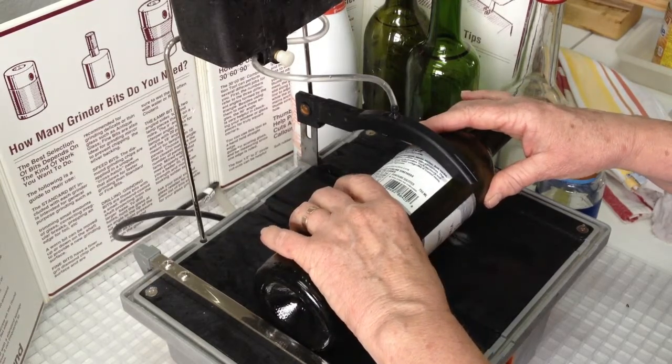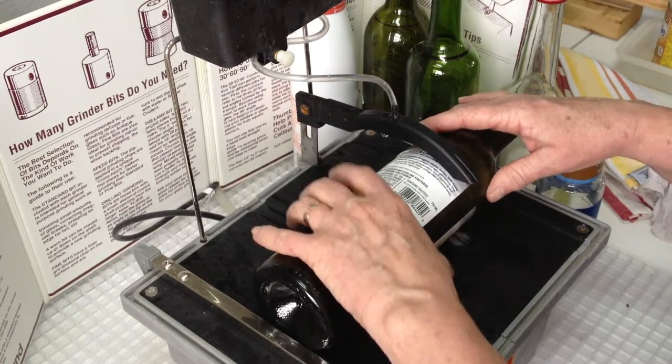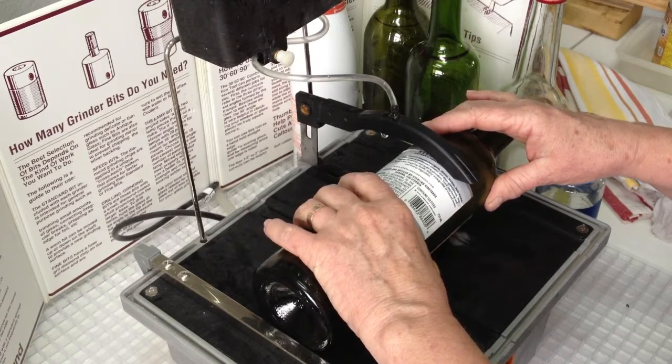It's important that as you're cutting, if you notice white powder or paste forming, increase the drip rate. You never want to use your diamond blade dry — it's the fastest way to ruin it.